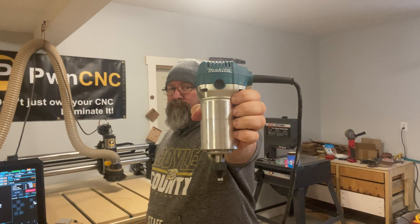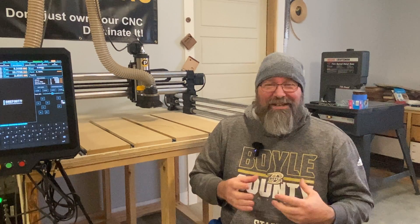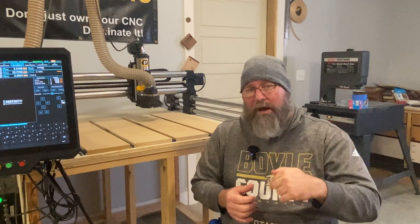Next, you'll need to decide whether you want to use a palm router or a spindle. When shopping around, be sure to check whether your CNC comes with a spindle or router because many of them, like the Onefinity, don't. Onefinity recommends a Makita palm router and recently began selling their own model of spindles. But realistically, palm routers or trim routers really aren't designed to be run for hours, which you may do with your CNC. I use the Pwn CNC air-cooled spindle system with a variable frequency drive, which reads the G-code for spindle speed and automatically starts and stops when you start your project. I have an affiliate link and discount code for Pwn CNC in the description.